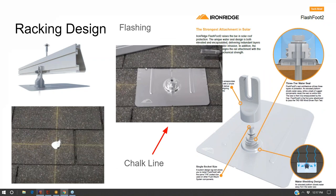Some installation technique: you tap the roof with a hammer or a rubber mallet to figure out where the rafters are. It's really something that only comes with experience. Another common way to find where the rafter is, is to get into the attic and measure off from the side wall. Again, that is not as easy as it sounds, because you have to get good at figuring out how far the sidewall goes to the outside of the house and then how far the roof hangs over the side of the house.